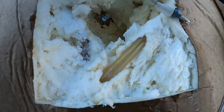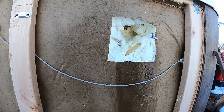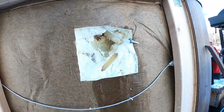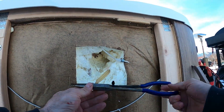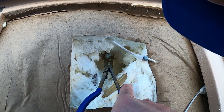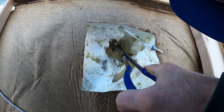As you can see it's nice and clear. With our new lock nut we can go ahead and push against the light lens on the tub side, then just thread that lock nut down and go nice and hand tight - that rubber washer is going to prevent it from leaking. Since these are kind of deep, a set of long-handled needle nose pliers work great to give it that last quarter turn to make sure it's tight and snug. We'll take our long-handled needle nose pliers and give it another quarter turn to make sure she's good and tight.